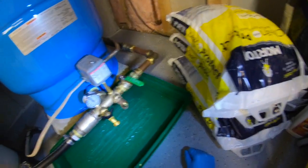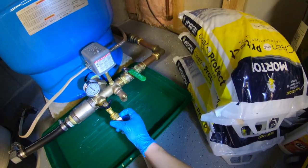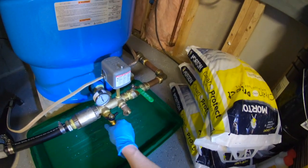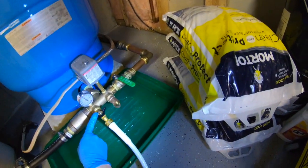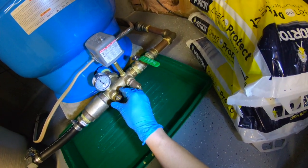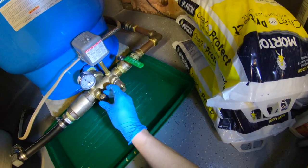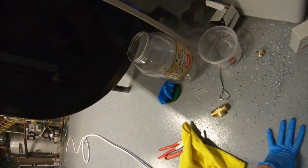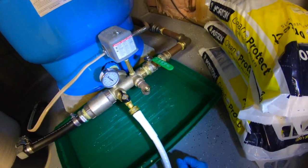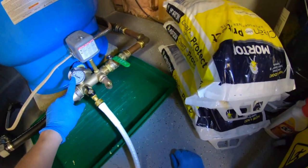The next thing I've got to do is get this pressure out. I've got my hose going out to a drain — I'm going to screw this in, and now that I've got the power off, as soon as I crack this valve, you're going to watch this pressure go down. You can hear the water coming out. I crack that open all the way, the hose is going out, and the water is draining. You can watch the pressure going down, and this valve is still leaking.